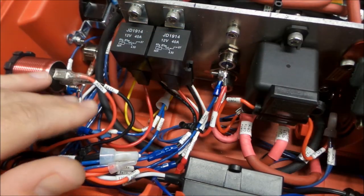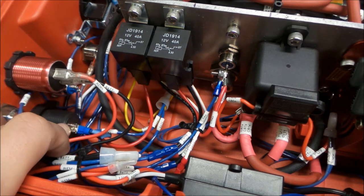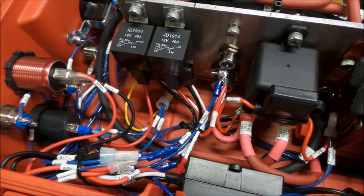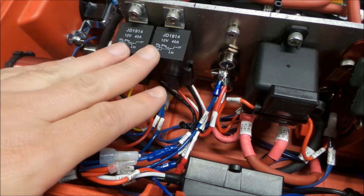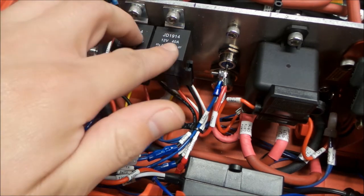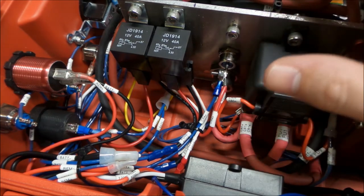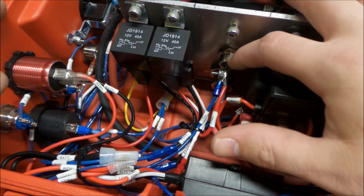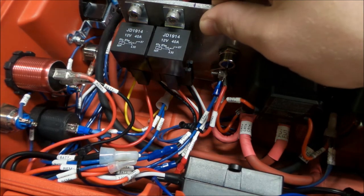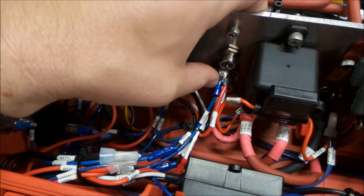So moving down through here, the last area that we'll take a look at, we went over our inverter and our regular 12-volt outlet. They're nice features to have on here. And we also have the relays here that turn the heavier duty 12-volt outlet and our smaller 12-volt outlet on. That's what these two are. Now we also have some diodes that we figured out sizing for. Basically, I doubled the expected current just about on these diodes, and we've mounted them to this piece of aluminum, this 10-gauge aluminum. It works really well as a heat sink for the diodes.